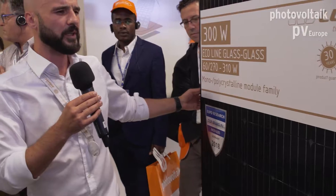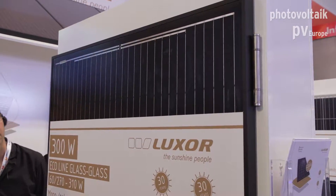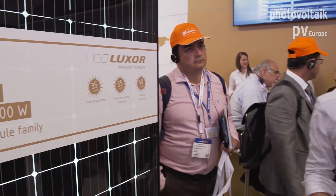It has a 2mm glass layer but without edge sealing. This panel fills the gap for larger projects where a glass-glass panel is needed primarily for cost reasons. It's produced like a standard glass-foil panel in a vacuum laminator — with a longer lamination time, of course — so it sits somewhere between a glass-foil panel and a high-end glass-glass panel.